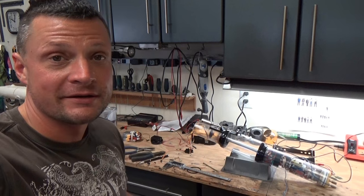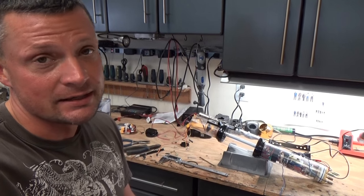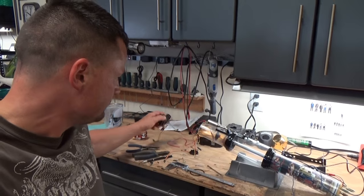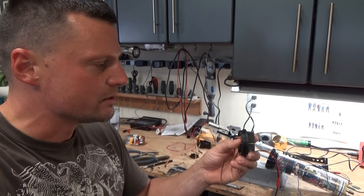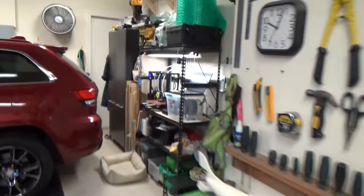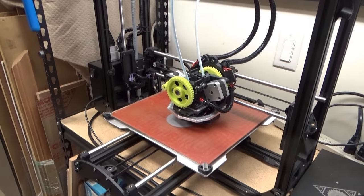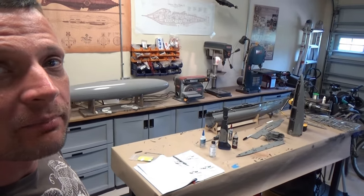The preliminary testing of the cylinder went really, really well — no issues. However, upon looking closer at the cylinder, I've decided to rework the front end cap. This is the old one — I have an integrated servo in there, but the thing I don't like about it is it was kind of an afterthought on my part, so it's sealed in there. If that servo ever needed to be replaced, it would not be ideal. So I've actually redrafted this and I'm reprinting it right now on the printer. The beauty of 3D printing means I can move on to other things in the meantime.